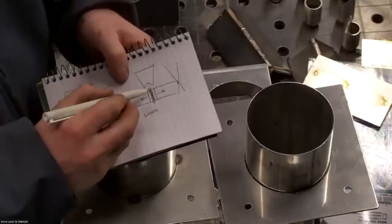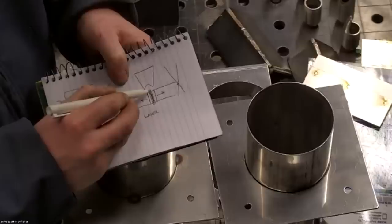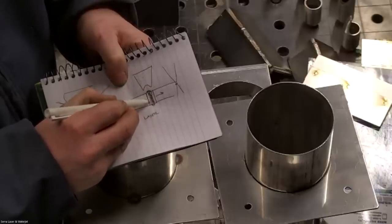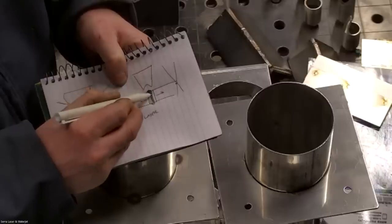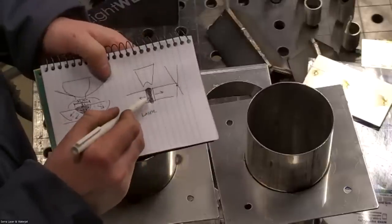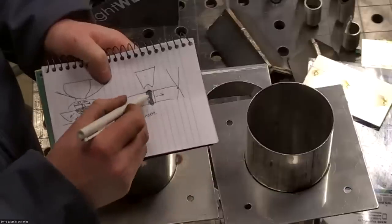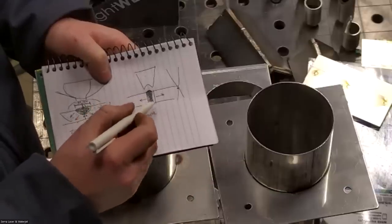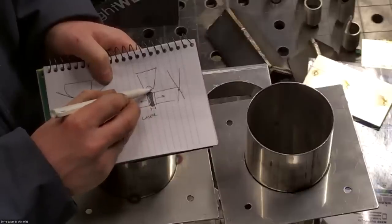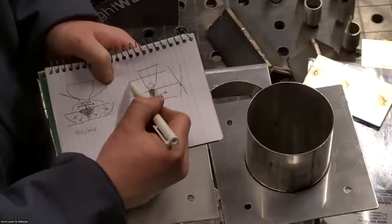And then because we are not relying on that weld pool to grow, we're just gonna get right to the point weld. Our weld is gonna be a little bit more of an hourglass shape like this. We call it a keyhole weld. So the weld will appear really small on the surface, but in reality, we have better penetration and more even bonding throughout. And then when it comes time for the material to cool and shrink, we have a lot more of an even area of shrinkage top and bottom,